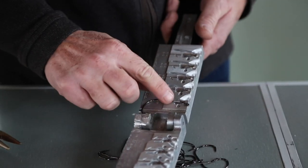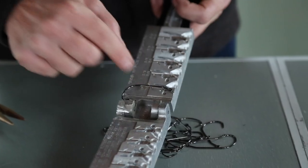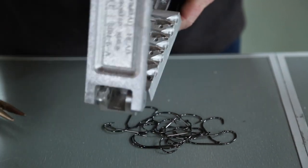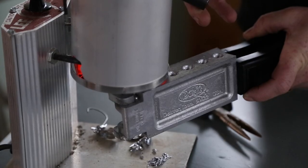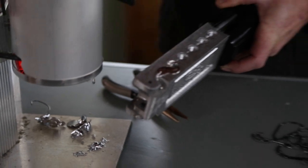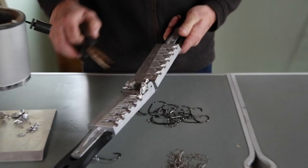To actually make the jig head, all you need to do is put the hook in the mold along with any other components, close the mold up, and have a lead melting pot. You put the lead in there and turn it on — it melts the lead — then you put the mold up under the pot, pour the lead into the mold, and wait for it to cool off. Once it's cool, which only takes a second, you can open it up.